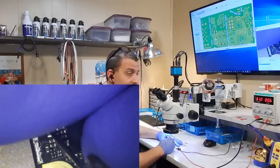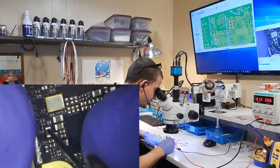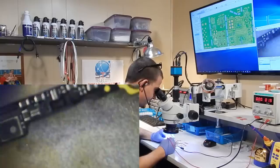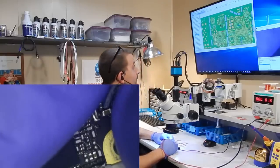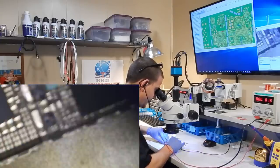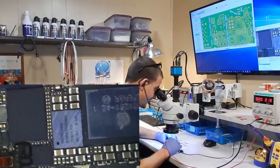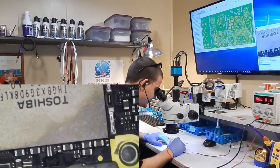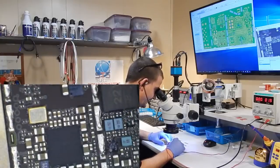How long can this thing dissipate three amps without getting warm? Geez! It's my probe getting hot — the board's not even getting warm. I'm not pulling everything off of VCC main to find a VCC main short. For data recovery, maybe. For the sake of a working phone? Nah. Let's see if we can't find this short — something is definitely shorted. Let's give it a little more power.